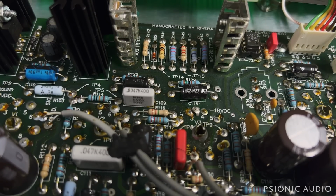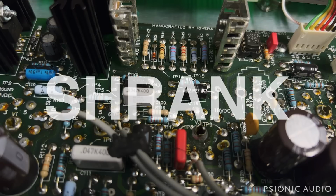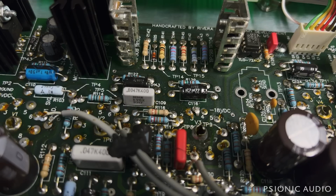And any one of these kinds of things, because there's more than one piece of this metal floating around inside, I'm about to shake it out, that could cause a temporary short just long enough to cause that cap to go, but I need to verify. So what I'm going to do is shake out all the little bits of metal that are in this chassis. I'm going to later, when I look at the cabinet, make sure that the foil's not all torn up inside. The reverb tank's not attached very well on that. That'll be a separate process.